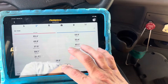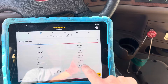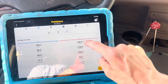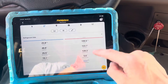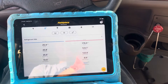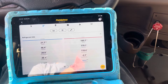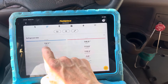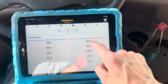Superheat is 10 degrees. Sub-cooling — I just heard the fan kick on. It's still going up — watch the pressure, look at the superheat and sub-cooling. The fan is on. That might be engine RPM kicking in the fan a little bit. Look at the low-side pressure — it's definitely on, the clutch has not kicked out.